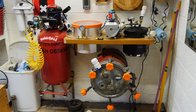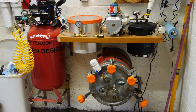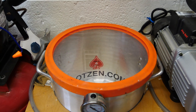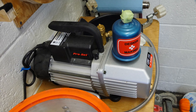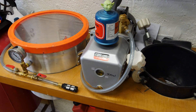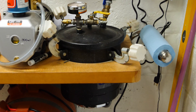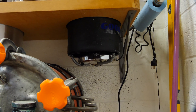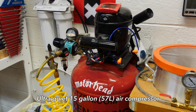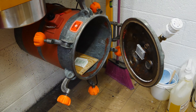Let's take a look at my resin casting station. On the left is a vacuum tank, on the right is a pressure pot, and below that is a bigger pressure pot. The vacuum chamber is a three-gallon unit that allows me to put my mixed resin in there and remove air bubbles. I use a 10 cubic feet per minute vacuum pump with a carbon filter block on top. On the right we have a two-and-a-half-gallon heated pressure pot — essential for casting clear parts. I pressurize that pot with a 15-gallon ultra-quiet homemade air compressor, and I also have a 10-gallon larger pressure tank for bigger projects.